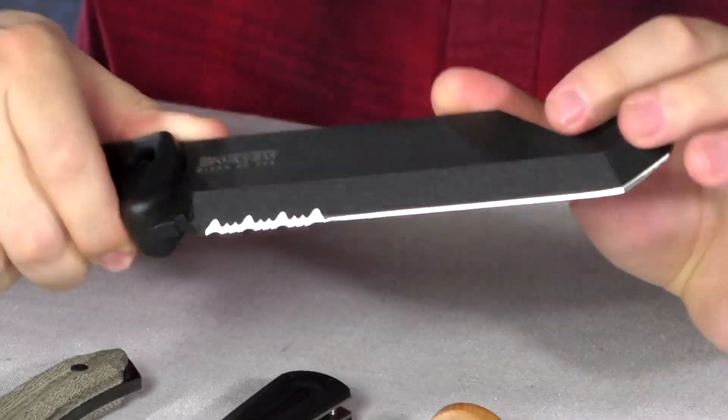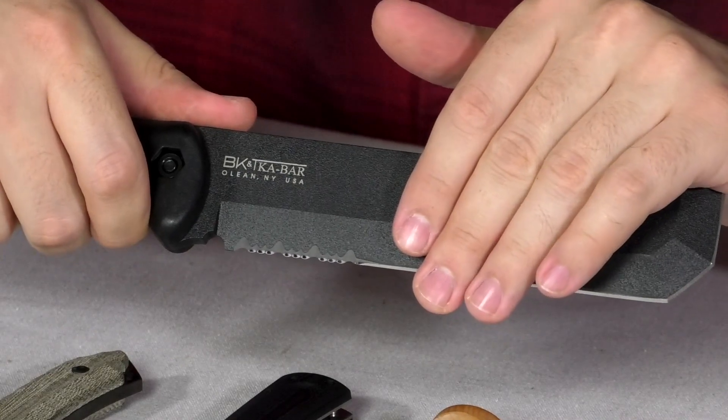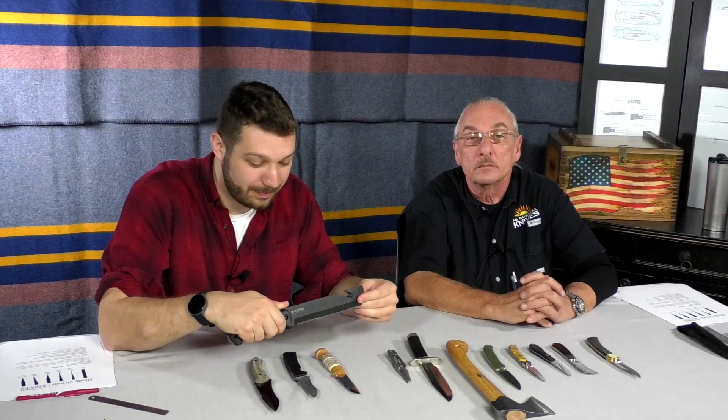This TakTool is a saber chisel grind — a single saber. It's completely flat on one side, and has a lower saber grind on the other for a more obtuse angle, making it a thicker edge. That's just one of the ways you can combine the parent grind types to get different results.